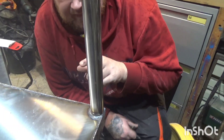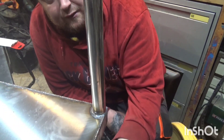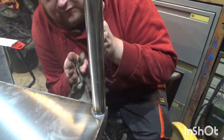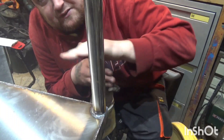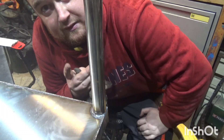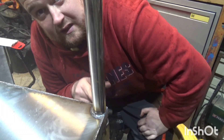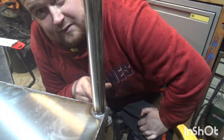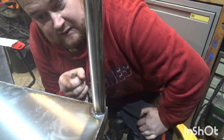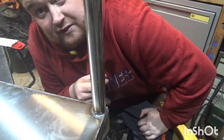Down here, I've drilled the hole as tight to the edge of the gauge of the bottom piece of steel, and I've placed this tube off-centred from it just slightly, so there's a step down. I want to make sure that condensation that builds up in this can just run out. Even though this is marine grade stainless, I'd still rather the condensation just run out.